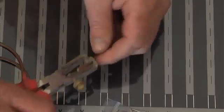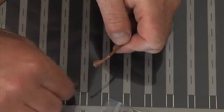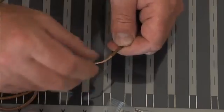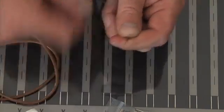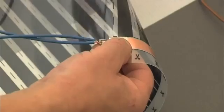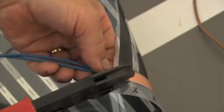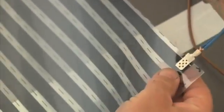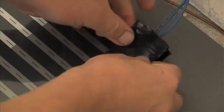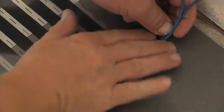To install the wiring, remove the double layer of insulation from the supply cable to expose 6mm of bare wire. Insert singly or in pairs into the cylindrical ferrule of the crimp connector and crimp into position with the ratchet tool. When inserting a single wire into the ferrule, the bare wire should be doubled over to fill the ferrule before crimping. Now the cables are attached to the crimp connectors, they can be fixed to both copper conductors at one end of the element. The crimp should be fitted using the supplied ratchet crimping tool with two diagonal applications — firstly from the hinge side and then from the open side — to ensure the whole area of the crimp is in contact with the element and pressed flat. The crimp connection should be insulated with the mastic tape provided in the kit. Place mastic on both sides of the connector and gently knead into position, making sure the connection is completely covered and safely insulated.